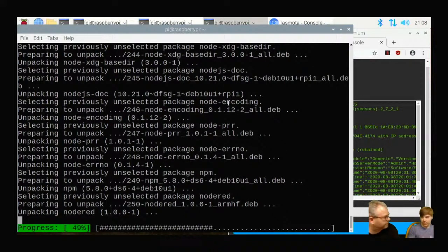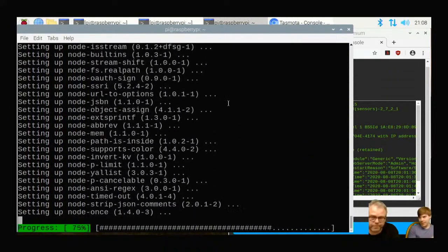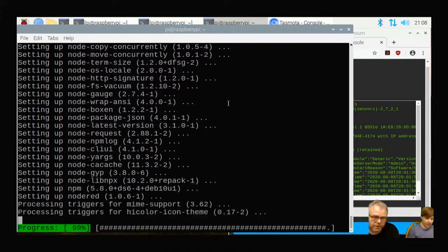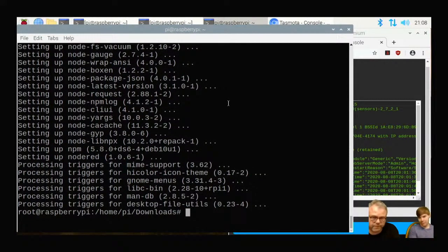And if you've got lots of different ESPs with sensors, you can replace any failed ESP if there does happen to be a failure. And if you have the Pi separate, you can do a backup and then recover it if the Pi fails. I think there was even a configuration for a secondary MQTT server. You can make the MQTT side quite reliable.